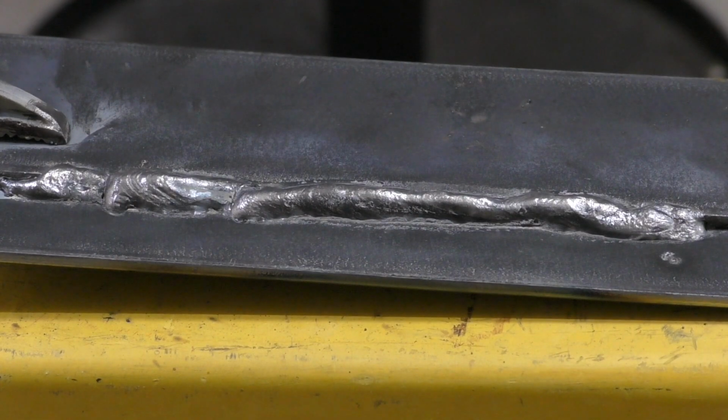So this is 1/8 inch thick material, and it's around 23 volts and 200 amps. And not my prettiest MIG weld, but plenty enough to prove out the capability of the machine. I'd really like to get some .045, some thick stuff, and wind it onto one of these small spools so I can try it at a higher voltage, higher power. But I think you need gas cooling for that to work properly without overheating the spool gun.